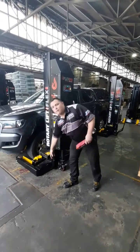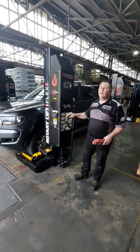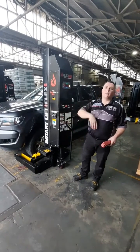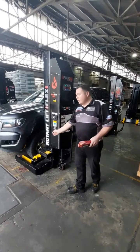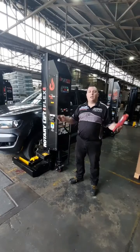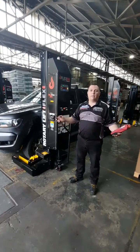We've got our forklift slippers here, meaning we can take these wherever we go. You can put them on the back of the truck. If you need to get them to the other end of the workshop, you can pick them up with your forklift and drop them down there. Our pins can go as close together as 9 inches and as wide as 22, meaning you can pick up everything from a forklift all the way through to a big excavator.